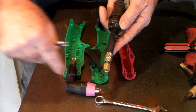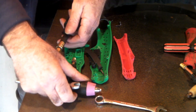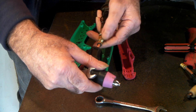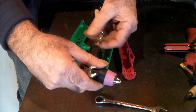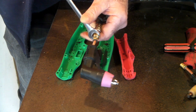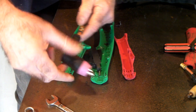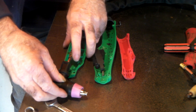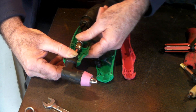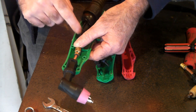Here's my original hose - there's nothing wrong with my hose so I want to use my original hose, but I want to upgrade and put a new torch body on it. So we'll just do it like this: take that out of there like so, put them on there like so, do them up - same as before in reverse - just tweak them up a little bit like that, stick them in here. There you go, you've got your body hooked up onto your lead.